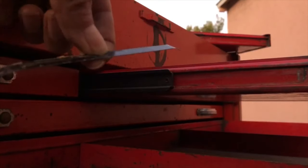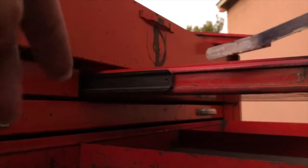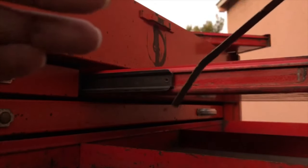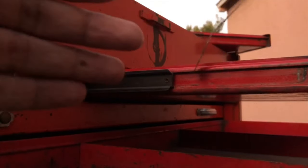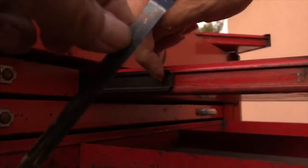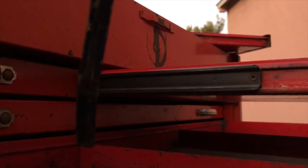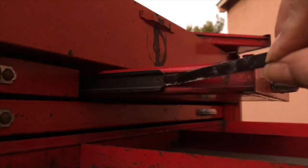Bend it a little at one end and a lot more at the other. There are catches inside — on the drawers they're like little dimples that stick out, kind of like a little louver on a hood of a car to hook air. But here they're hooking a metal tab inside. So when it comes out, the tab catches the louver and stops the drawer from opening. What you want to do is push the tab in so it slides over the louver and doesn't catch.